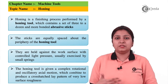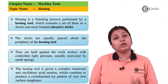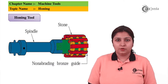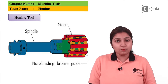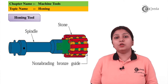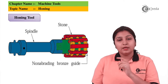In this diagram we can see the honing tool — there is a spindle which provides rotary motion, and there is a honing tool on which stones are attached. During a normal honing process, when the spindle actuates, the stones on the splines get opened and the exact finishing operation takes place.